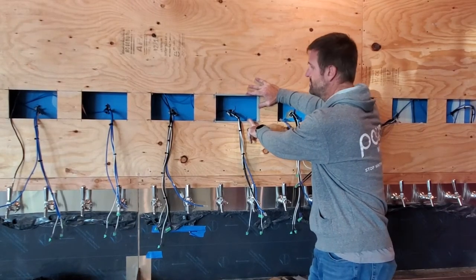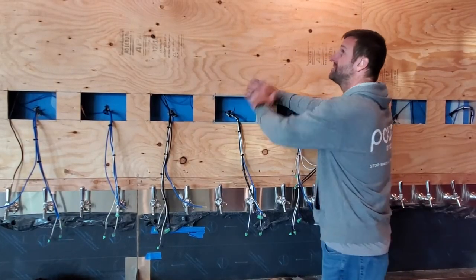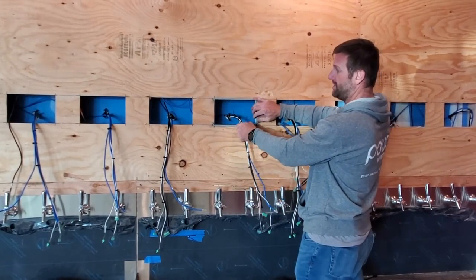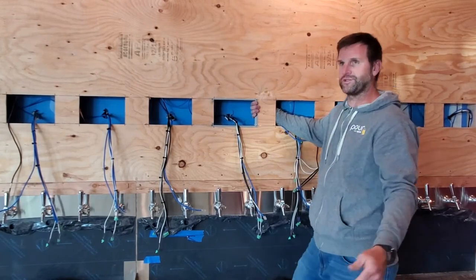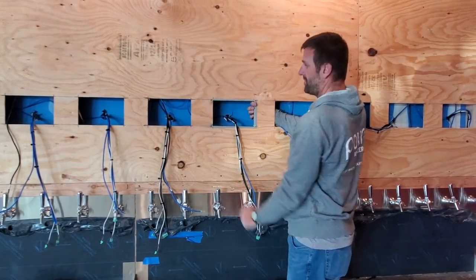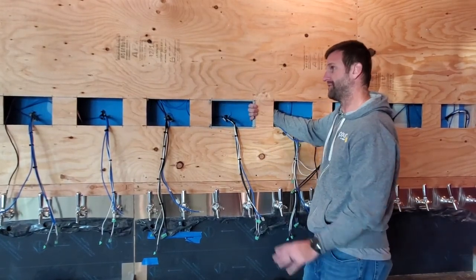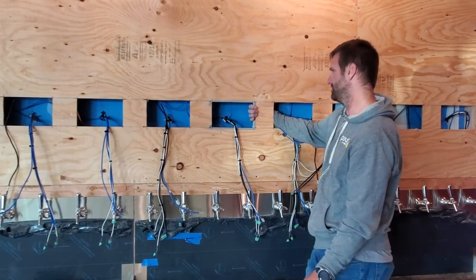These metal frames that we have to mount on your tap wall in order to attach the screens have to be mounted on a finished surface. As you can see right now, there will be a finished veneer going on this tap wall, so this frame cannot be mounted yet — we will mount it after the finished veneer goes on so we can affix the screens. The other problem we see happens when folks doing tile walls set the frames in and tile around the mounts, which causes the screens to be recessed, meaning we can't affix them to the mounting plates because we can't get the tools in. The screens cannot fit flush in the wall; they have to sit outside of the wall by about a quarter of an inch of the actual screen frame itself.